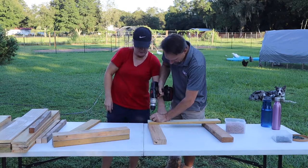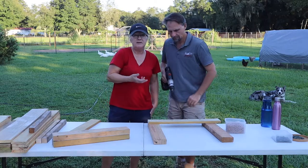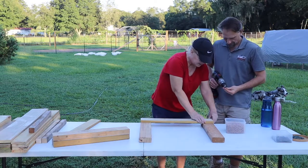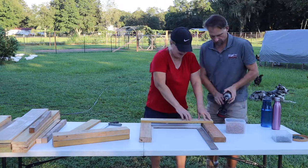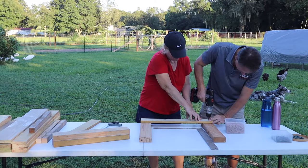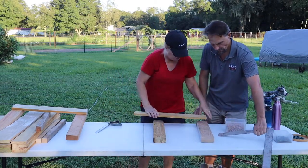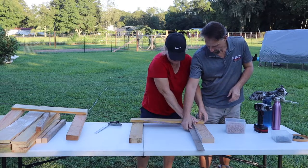Put one in one corner there and one up here. You don't want to get too close to the edge because you can split the wood. If it were me doing it, I'd have to do pilot holes - that's why I have Honey out here with me today because it's a whole lot faster when he's here. Now we did decide to use a square to help keep things squared up. This lumber is just literally scrap pieces we have around - nothing fancy, you just use what you have. It doesn't have to be new.